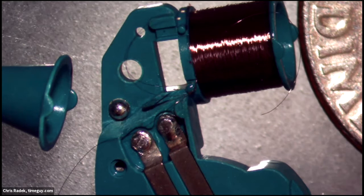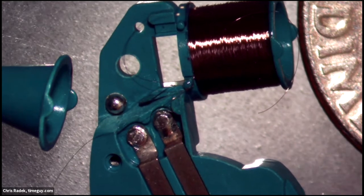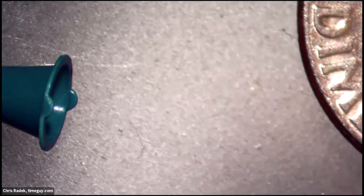After that's wound on, I solder those wires, clean up the flux, and then coat it all with protective coating so it doesn't get damaged. A lot of these fail from corrosion from the battery. The other thing I see all the time is that they're damaged in servicing — gouged with the tip of the tuning fork, something like that. There are hours of work in each one of these that I do. As far as I know, I'm the only one rewinding those.